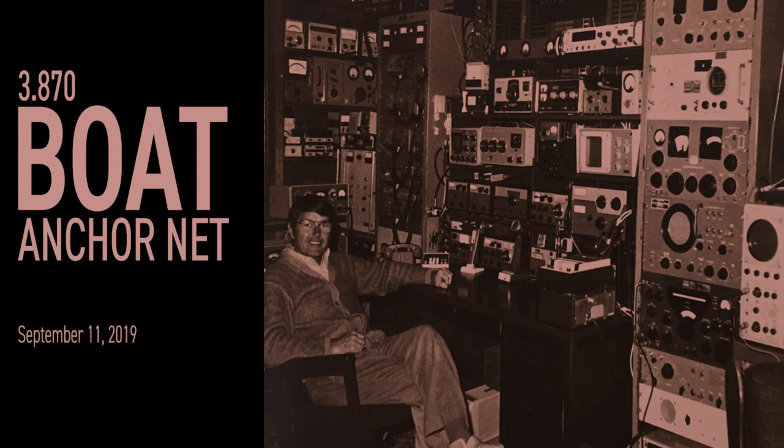Alpha Delta Charlie. Hello, Rick. Go right ahead. Yeah, Whiskey Delta 5, Alpha Delta Charlie. Rick in Harlingen on the TS820, TL922 amp, Shure 444 mic, and antenna up about 30 feet. And about that stuck slug thing, it probably has wax in it. I've run into that quite a bit on some of the older rigs. And heating that wax up, or if you can find some, what dissolves wax really good, but you can't get it anymore, is carbon tetrachloride. A drop of that would do it. But either heating it with a heat gun or a pencil tip soldering iron just right in the center of the slug, it'll dissipate the heat and should melt that wax.